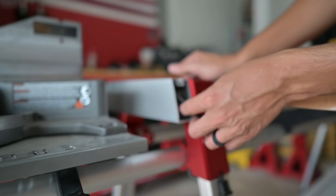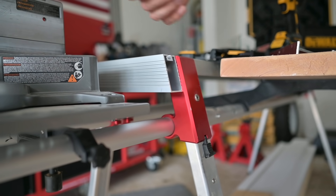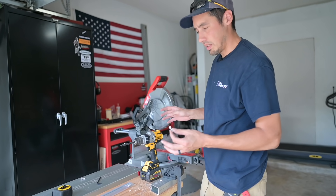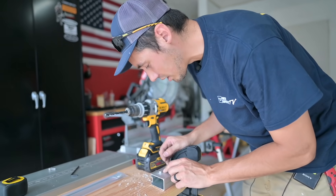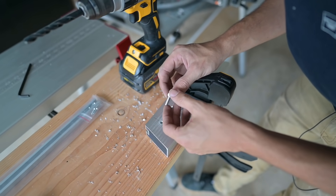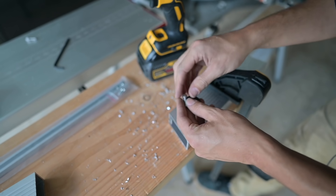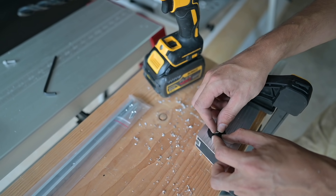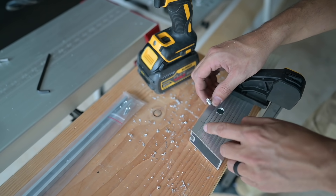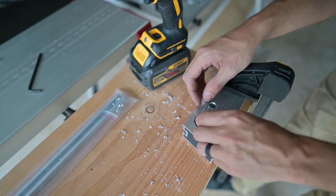I'm wondering if we may have to find a smaller one of these or trim it — we could just make a hole in here and do it that way too. Quick change of plans — same concept, but since this hole has to be so precise with my pencil lines it really wasn't lining up too well. What I decided to do was drill it out to a bigger bit and use these four washers. When I put this in, it'll just hold and grab on the inside — which is good anyway, because it puts pressure on this piece of steel rather than just the aluminum, which is a lot softer.